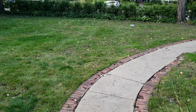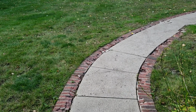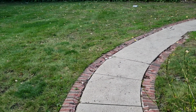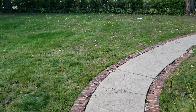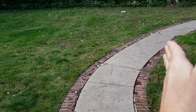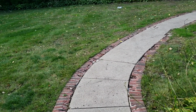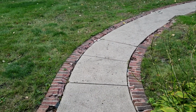We are going to bid this 6 feet wide for the straight run, and then at the sidewalk, it's actually going to bump out to 12 feet. So it's 6 feet, and then it'll bump out 3 feet on each side, approximately, because the sidewalk is at an angle there. So we're going to say it's going to be like 2.5 feet over here, and like 4.5 feet over here from front to back. Think of it like a pad on the far side that he's going to put a gate around, and he wants to be able to put some urns on there. So Sherry, if you can do a sketch above this just so he can kind of see what this is.